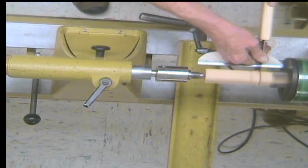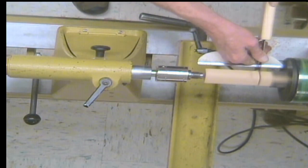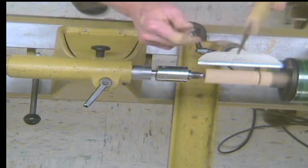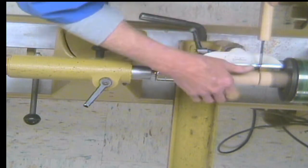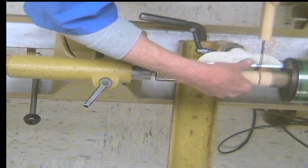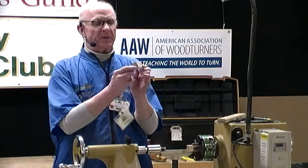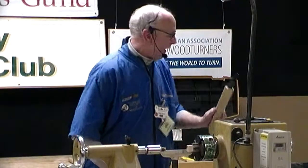Do this. Now, I'm not worried about this twisting off here. I'm going to part it all the way through, as opposed to taking it off and carefully cutting it with the saw, because all the center's coming out anyway. So again, time-wise, you do this, and you get rid of this longer part here, which is the body. You put it over here. Of course, you know which end is which, so the center is marked on the tail end of it. Put that there.